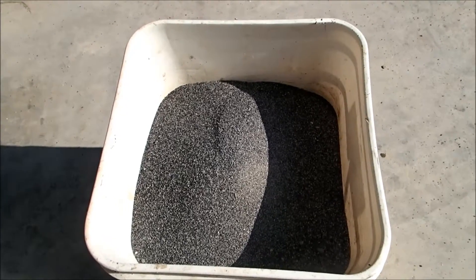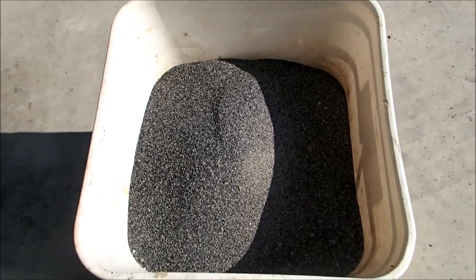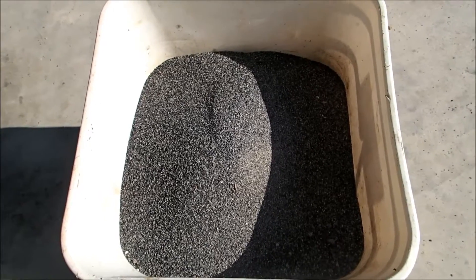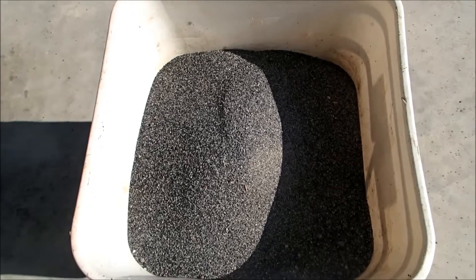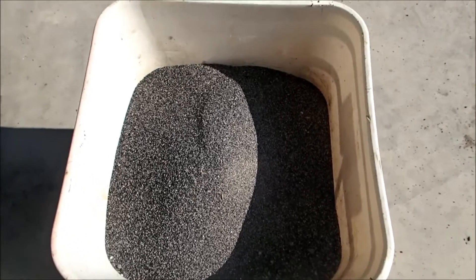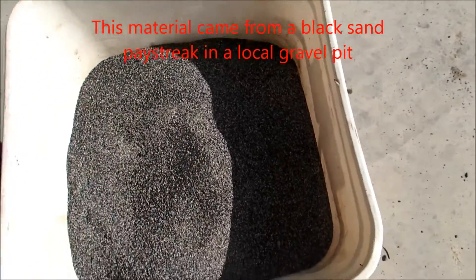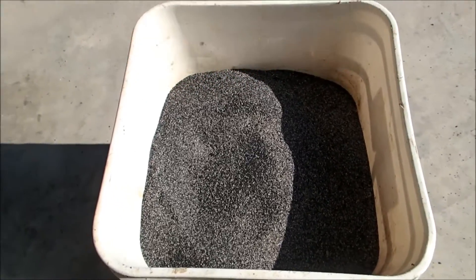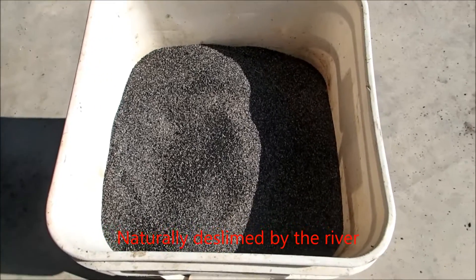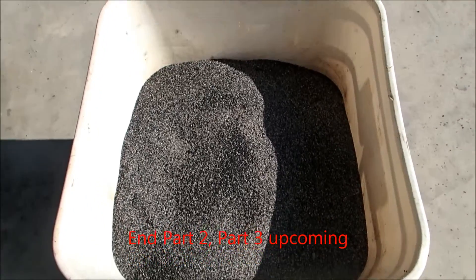After attempting to de-slime that sand I was using yesterday, I found out that about 70% of it was smaller than 100 mesh, and it would have taken half the day to end up with a five-gallon bucket of that material with the 100 mesh cleaned out of it. So I looked around the shop and I had this material — I don't know exactly what it is, but it's clean river sand from out here in the Snake — and I think it's been mostly de-slimed. There may still be a little bit in there, but I'm going to run that and we'll see how it does. We've got about four gallons of it here and we'll see what kind of reduction we get.